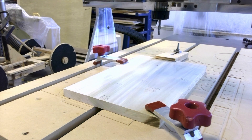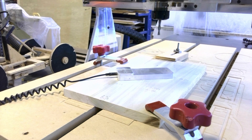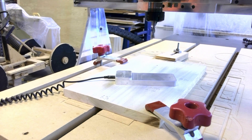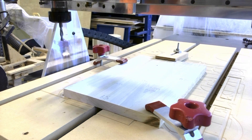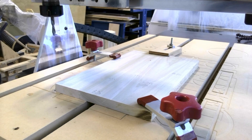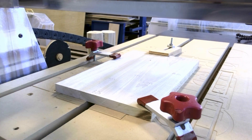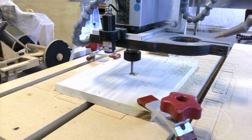I've cut down some footage — this is me re-zeroing with the zero plate once more before I get to cutting. The whole file processing portion took about 30 minutes total, and cut time is about 15. Right now it's at zero, measuring the tool, and once it's done measuring it gets into cutting right away.